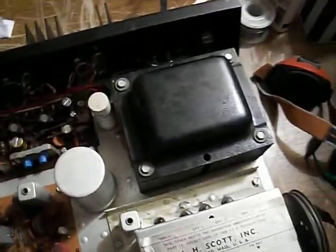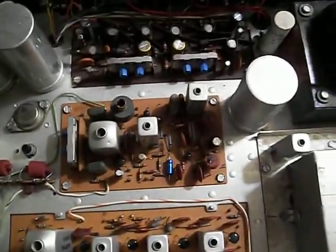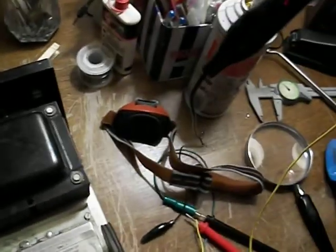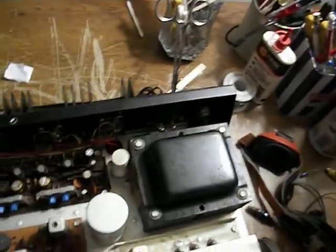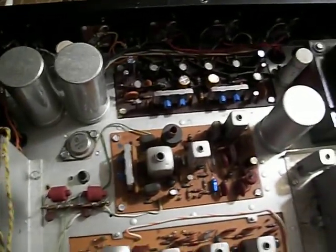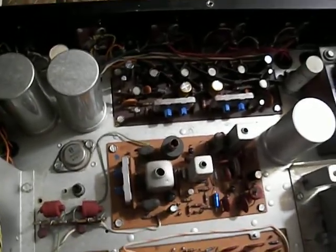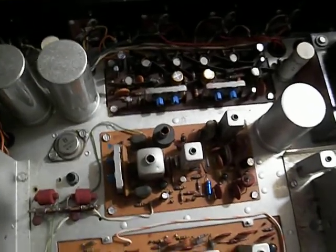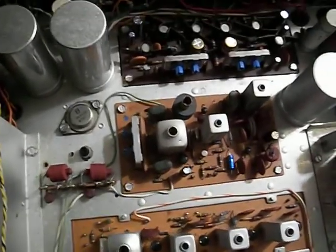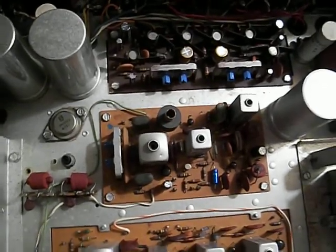If you don't get a good pilot tone you hear a hiss in the background, and you can switch the stereo off but then you don't have any stereo. Anyway, I'll put this cap in there. The only other thing that's weird is it's a 1µF cap and all I have is a 10µF. I should probably use the right value cap. I don't know if it really makes that much of a difference in a cathode bypass — going too big can't really hurt, and a larger cap won't really help or hurt because it just doesn't need any more than that anyway.